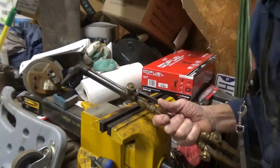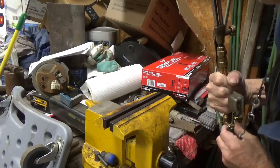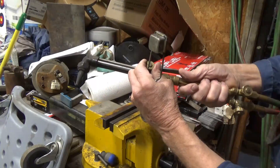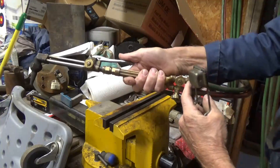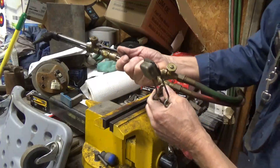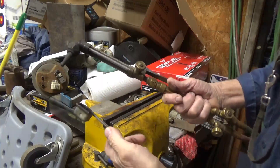I'm going to back this out a little bit and turn the acetylene on just a little — I can just barely hear it coming out. If you're somewhere noisy, blow it in your face until you can just barely feel some coming out. Then turn the oxygen up — you can turn this all the way up if you want, because you're going to control the oxygen mixing with the acetylene using this valve. For cutting, all the oxygen from your valve, pressure regulator, and hose comes out full blast. But for preheating and welding you have to carefully adjust these. With just a little acetylene coming out, you want to add a little oxygen — otherwise you'll get black sooty spider webs floating around when you light it.